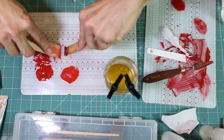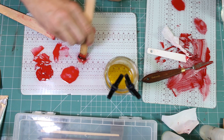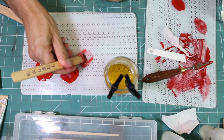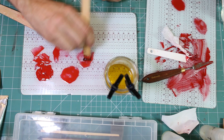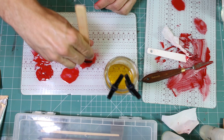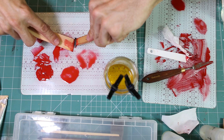This process requires quite some force — you have to pump the Urushi from between the bristles, not just swing the brush around, but push slightly harder to force it out. As you can see, each repetition gives a slightly different color because the Urushi is getting diluted. This is the third repetition. Push the oil — with traces of Urushi — out of the bristles and repeat.